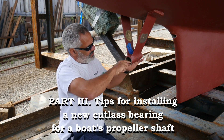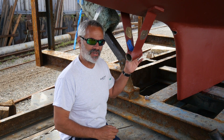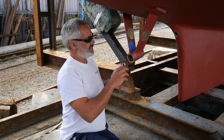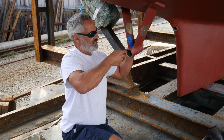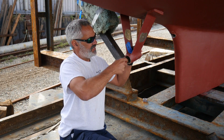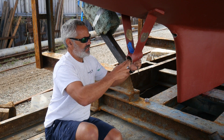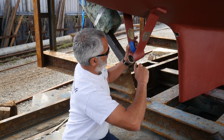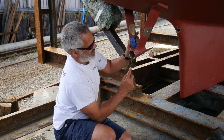Welcome back. We've got a slightly undersized rat tail file but we're doing real-world bolt repairs — functional. A bigger one makes it easier; this isn't bad, it's just slower. We want to make sure that any burrs, deep scratches, nicks, barbs — basically any imperfections — are out of here so that when the new one goes in it doesn't hook up on anything.